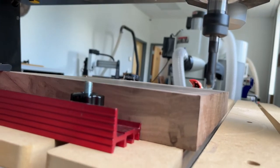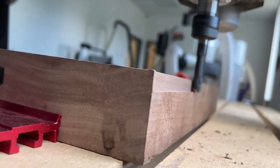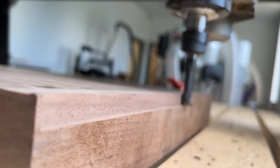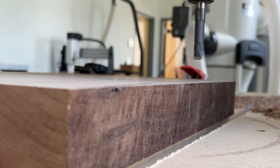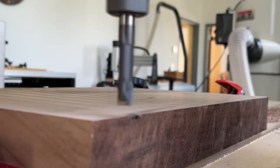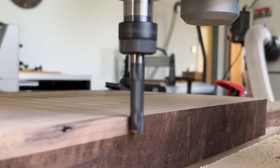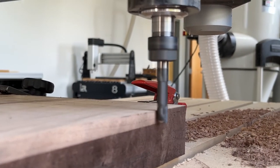Your choice for this part if you want to use dust collection — safety-wise it's still recommended, but these types of cuts always look pretty cool. Once you have one side cut, it's a rinse and repeat process for the rest of your edges. You can now use the straight edge and flush it against your fence to ensure parallel and perpendicular cuts depending on how you're orienting it.